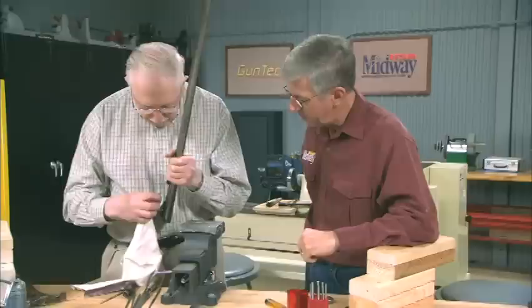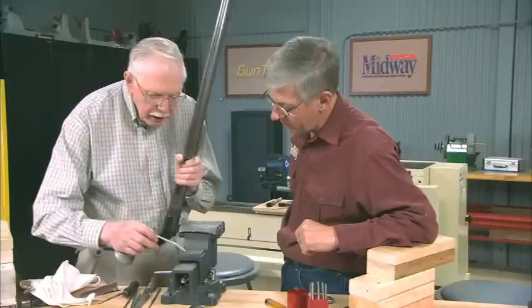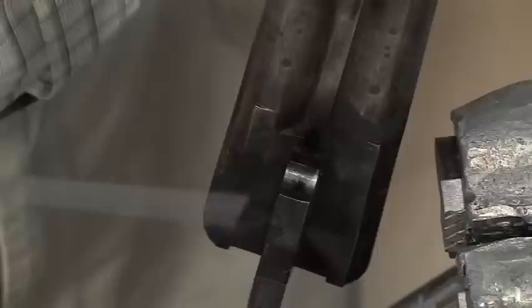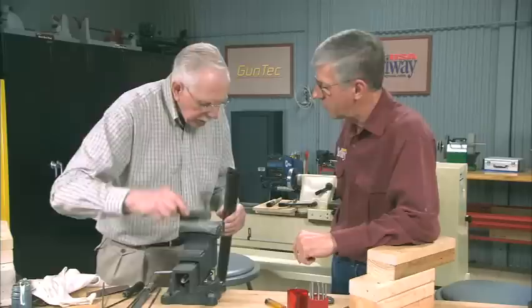And the next thing is you need a little tiny spot of oil on there. You don't want too much. Get the end of one of these files and just put a little tiny touch on the center of the hook there. I don't want too much oil. Now that'll stop it binding and galling the hook with the movement of opening and closing it.